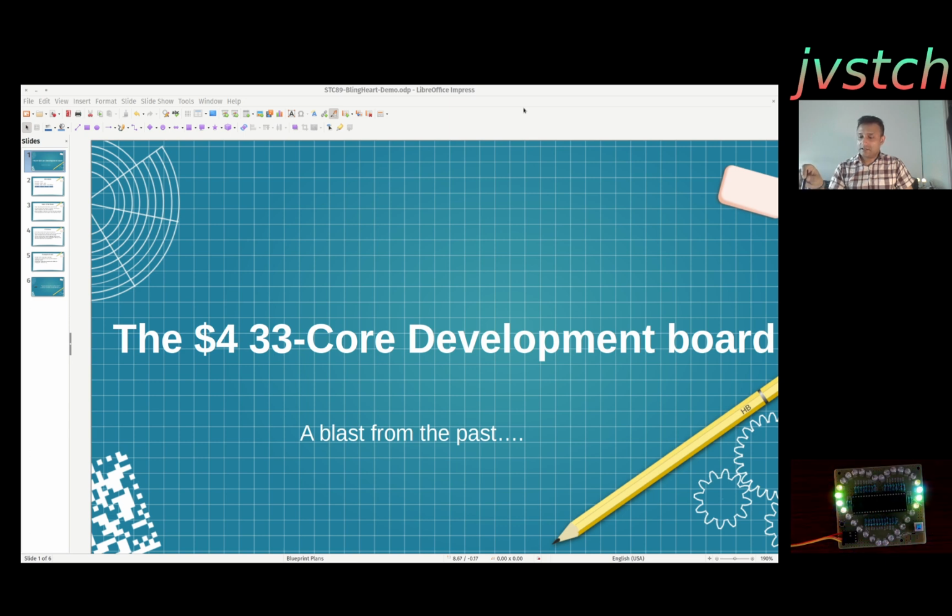This used to be a premium. I think around 10 years back it came, and now it's available very, very cheap, right? So what this does is, I think each of these LEDs has got at least a 4-bit microcontroller, which has got a ROM pre-programmed with the color changing effects, right? I think it's using 3-channel PWM and a 4-bit microcontroller with the pre-programmed ROM.